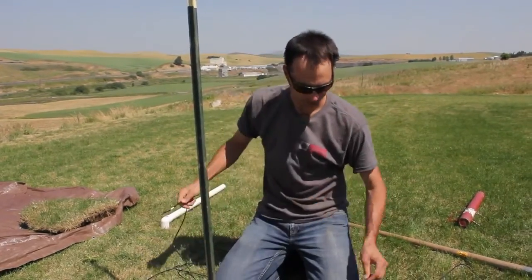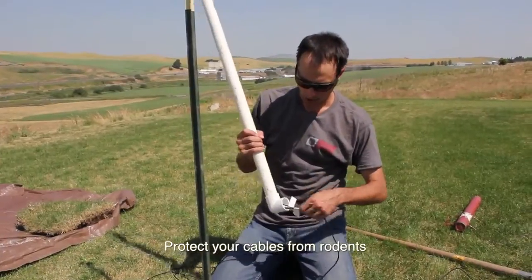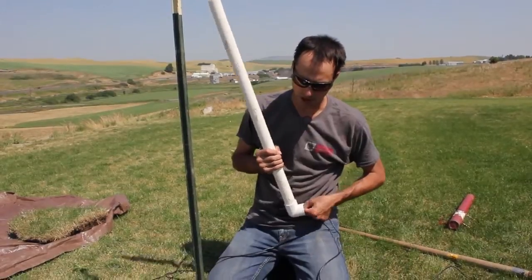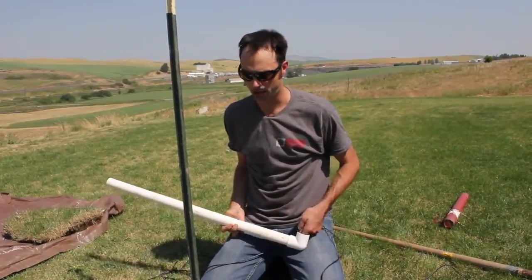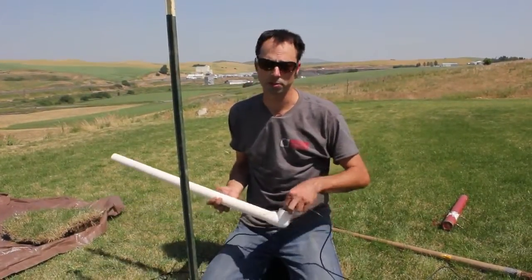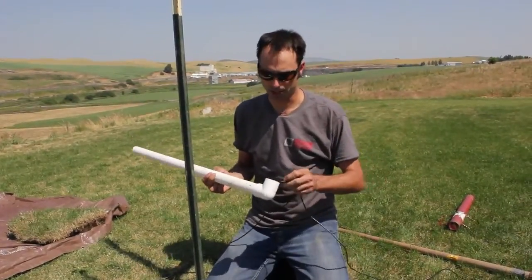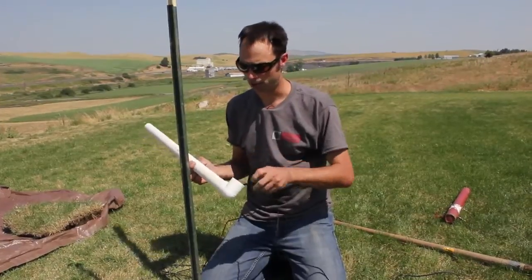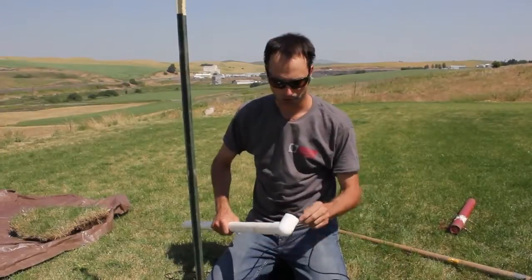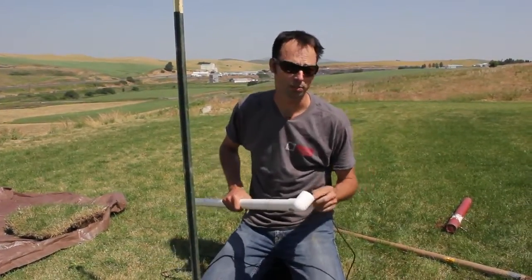We like to protect our cables where they come out of the ground. Rodents are one of the biggest problems in field installations. The cables do have rodent-chewing deterrent, but it only goes so far. The best installations protect their cables either by burying them or by running them through some type of conduit like PVC or electrical conduit to keep the rodents away.